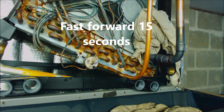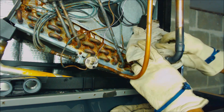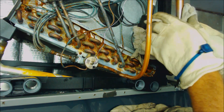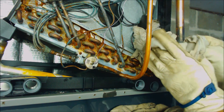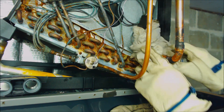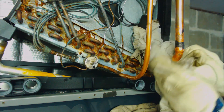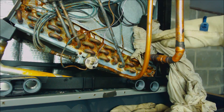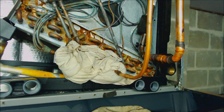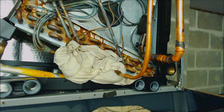Once it's cool enough, you can go ahead and quench it with a wet rag. There is a fallacy out there that after the braze rod is dry, if you quench it with a wet rag that could make leaks — but that's not really true. As long as the liquid is actually dried from your braze rod, you can go ahead and cool it down with a wet rag. I do it so I don't get burnt, and also just to make sure that the bulb is cooled down. We have our wet rag wrapped all around the TXV, and we don't have to move the nitrogen outside because the nitrogen is coming in this way and then exiting back out to the open port outside.